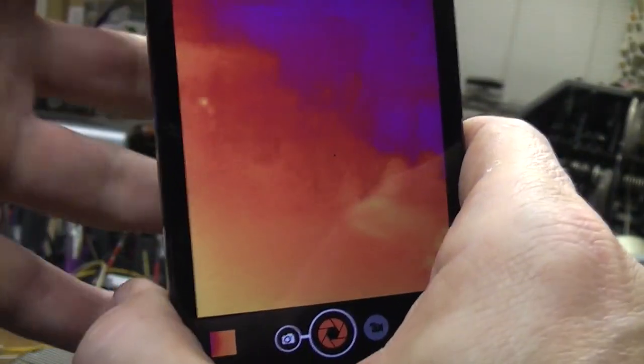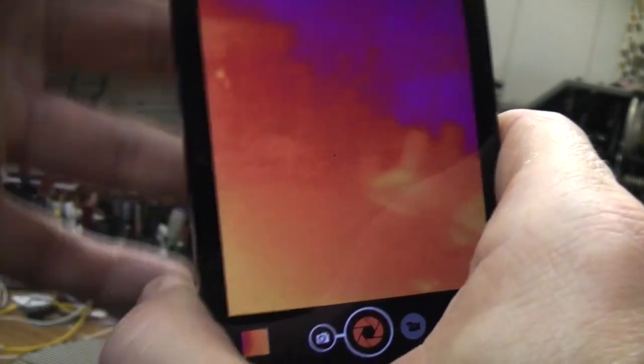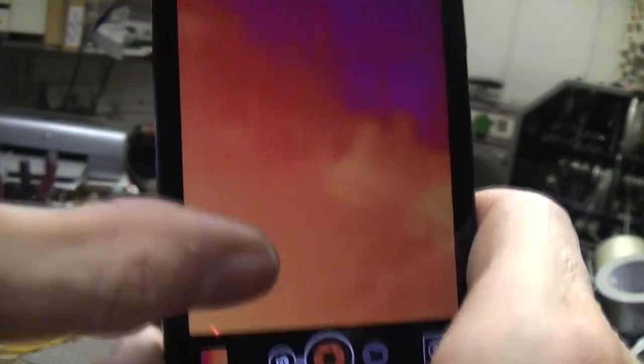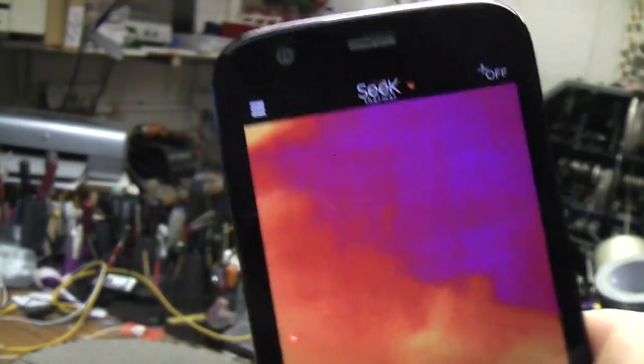That may just be because they're doing less filtering on it, but the other thing that's quite noticeable is the actual range, effectively the intensity resolution on this. What they seem to have done is lock the display range to quite a wide temperature range, and it doesn't seem to change that much. And again, I think that's to make the sensor noise less apparent.